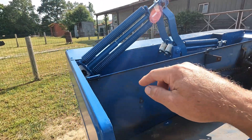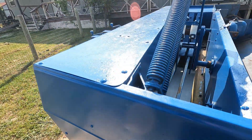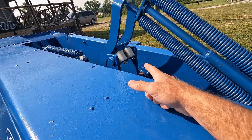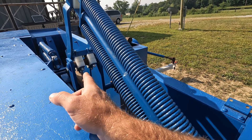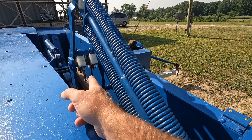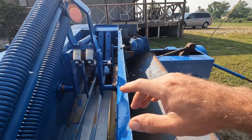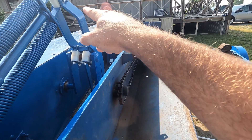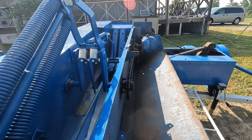Now that this is done, I've started putting the new bearings in — all new bearings are in place, some new hardware. The U-bolts are still original because they're a special size you can't just get at a hardware store. They need to be about an inch and five-eighths in between, and store-bought ones come in two-inch increments, so it's hard to find one. New bushings are in, and brand new cotter pins — because a broken cotter pin is what caused this whole havoc in the first place.